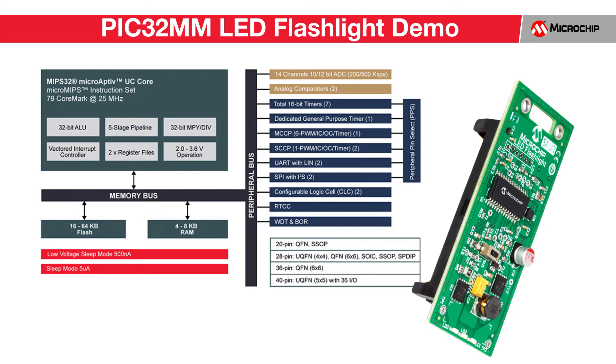It offers performance for implementing a PI control loop. The PIC32MM has plenty of memory for the LED lighting control algorithm, motion sensing and calibration code, and a light footprint communication stack. The low power modes on the PIC32MM help extend the battery life. Core independent peripherals like MCCPs and comparators help offload the CPU, and small 4x4mm UQFN packages enable a compact end design.